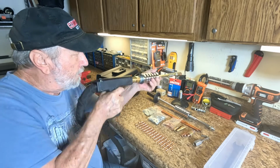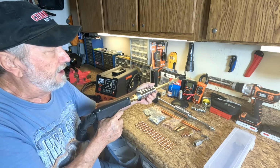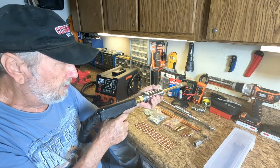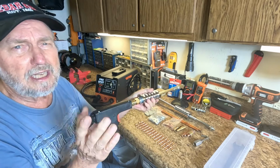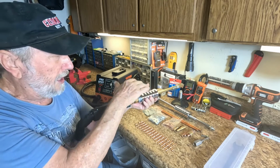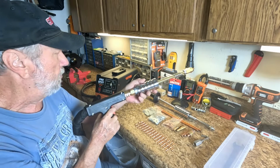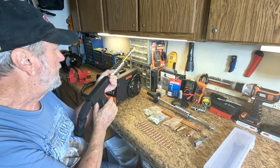You may have to break it loose, and to break it loose, you can twist it or move it up and down, and it'll break loose real easy. But pulling straight out, it doesn't. Then you may have to move over a spot, pull the trigger, pow, and then you do the same thing. So that's the action, and you could go through most of the dents and pull them with this action. So you don't have to actually weld and then change and all of that. This could be the workhorse. The others are for special applications that you find you need.